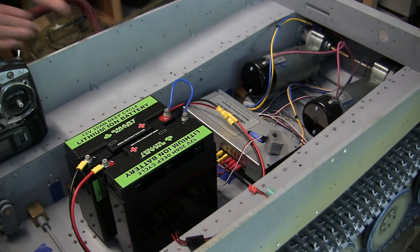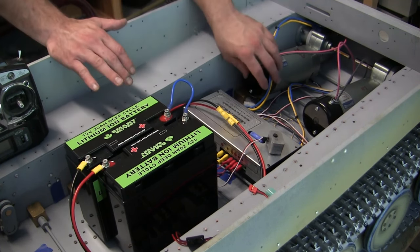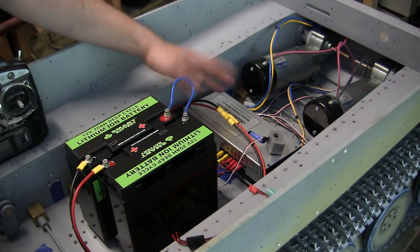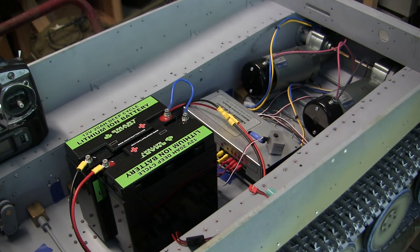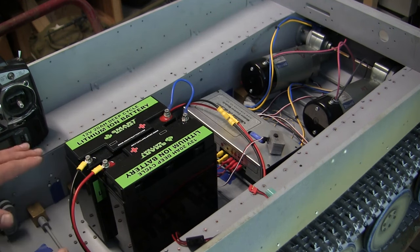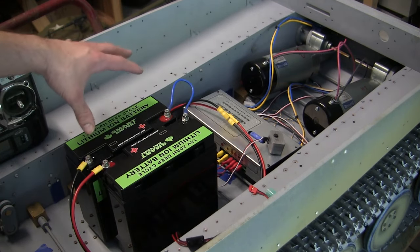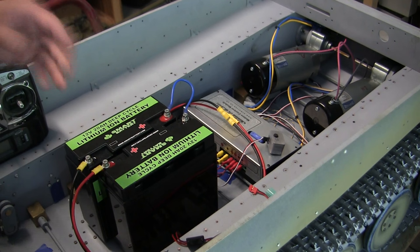As for patching the new system with the old motors, this was not hard to do at all, as the original motors were 24 volt powered and all Armortek kits are 24 volt. With this system here being 24 volt, there was no voltage issue to worry about in patching the new with the old. Now, this is something that is commonly seen on a lot of secondhand Armortek Tigers and models that are floating around. A lot of people, when they purchase the kit, purchase it without the option pack supplied. By the time they get to starting the model, the original option pack that the model would have originally been offered with may not be around anymore.